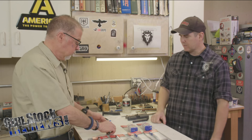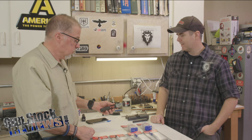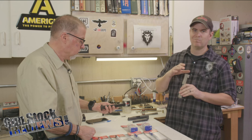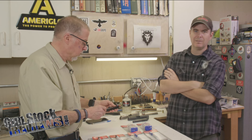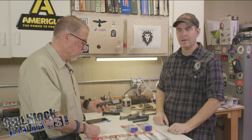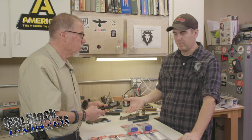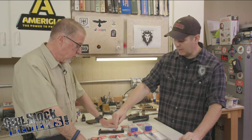Then you've got this Glock slide over here. The Glock slide has a factory finish. If it's made in America, I believe they use some sort of gas nitride. Like MP3 or Armor Lube, it's a plating applied to the exterior — it's kind of a candy shell. The surface of the metal is actually much harder than the steel on the inside. So when you had this machined, this is a good opportunity to talk about touch-ups — now you have bare metal. You don't want it to rust, but maybe you don't want to have the whole thing refinished. There are options like Cerakote, Duracote, or BlackNitride.com, where this could be re-nitrided and you'd have the same finish throughout.